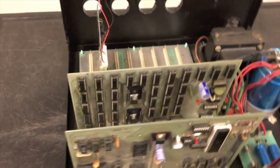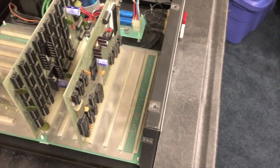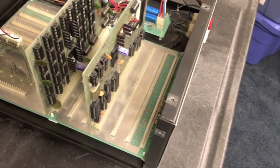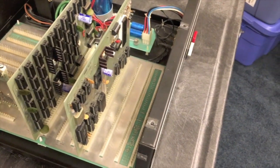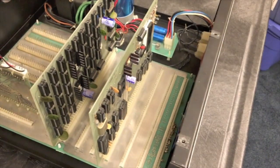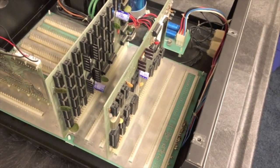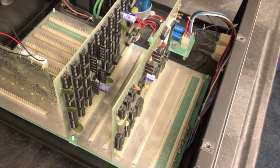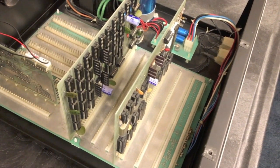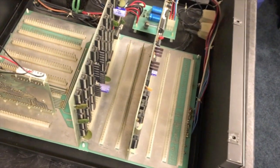You also see that we have a full motherboard here with seven slots in it already. Instead of 100-pin sockets, these are 50-pin male headers. It's a very strong connection — very hard to get on and off, frankly — but it made for very good insertion and reliable contact. It was 50 pins instead of the 100 used with the Altair and the S100 standard that eventually developed, so there's a simpler interface on all these cards and a chip or two less required to interface.